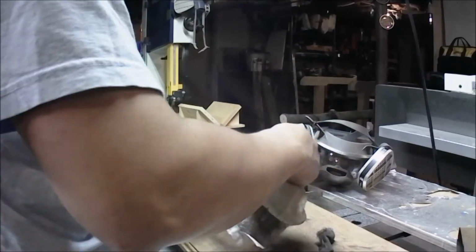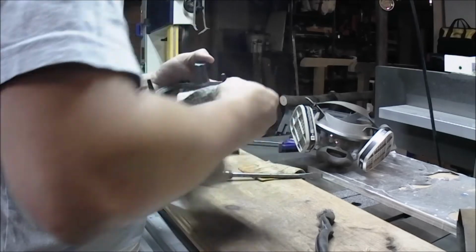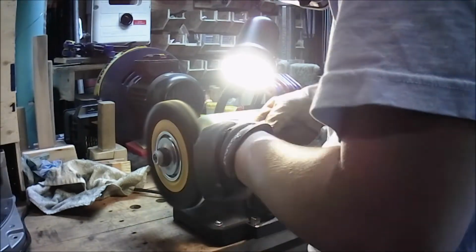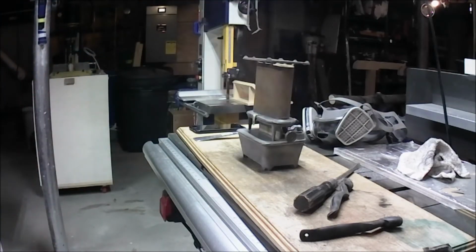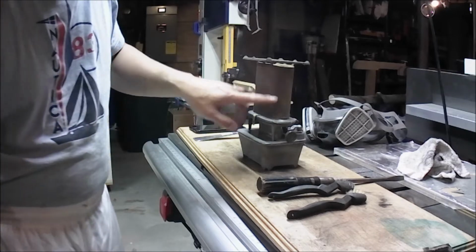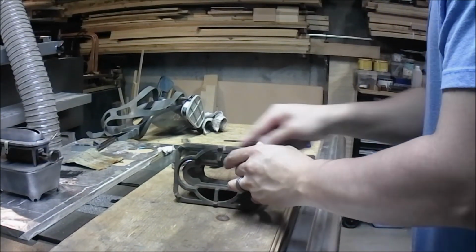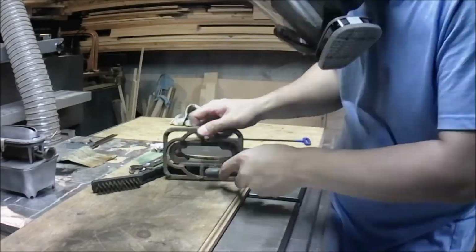Here I have just finished sandblasting the burner and moving on to temporarily reassembling the burners to see how it looks. The next step will be electrolysis. Here is a quick glance of the tin part of the burner that is still full of rust. I have done the electrolysis off screen because there wasn't much to show, but the electrolysis removed all the rust and only a little bit remaining, so that I had to clean up with the brush a little bit. And then I proceeded to give a nice polish using the cotton wheel.